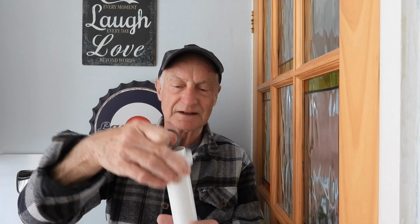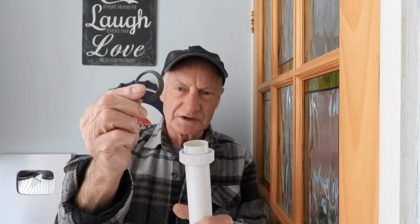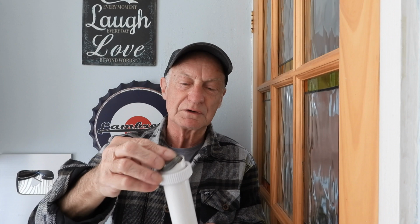Now on the top of it, if you get a leak running down from the actual siphon, then it's usually this nut here. We've got a little rubber washer, and it's that we need renewing. It goes up cone ways like that. You've got a shape to it, and it kind of fits over like that. It inserts into the siphon quite a way, and then you just do that up into it. Okay, and that should be fine. So it's usually only this washer.